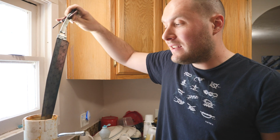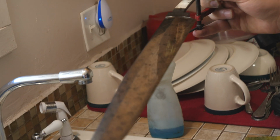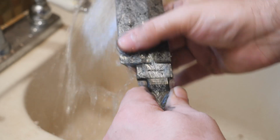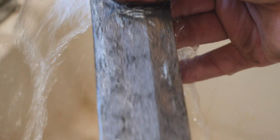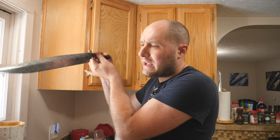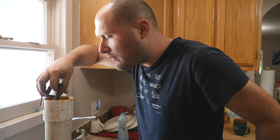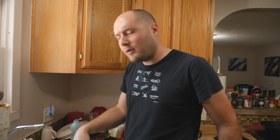It's been about 10 minutes later, plus or minus a little bit. Take it out. Rinse, neutralize, sand, repeat. Just got done with another hand sanding cycle on this and cleaned it up, put it back in for the final etch. I'm probably gonna do another 5 or 10 minutes or so, which should make the total time come out to be about 25 to 30 minutes.